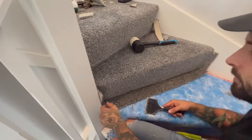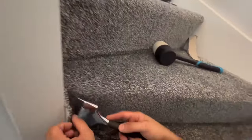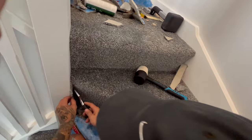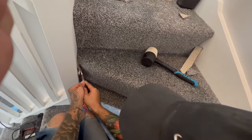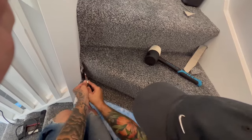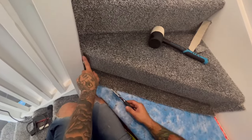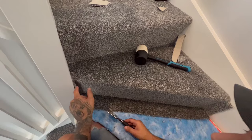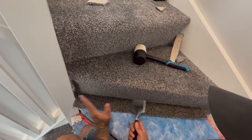On the sides here — if you don't have knee kickers just use the bolster for now. Take your slack and put some pressure into that corner, giving it a little bit of side stretch. Some people don't use side gripper at all and just roll the side, which is fine, but using the gripper enables you to get some side stretch.